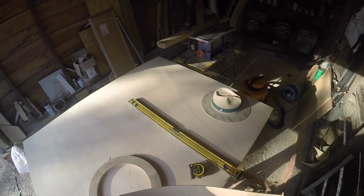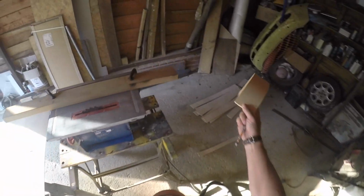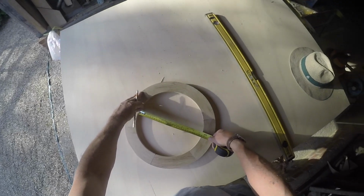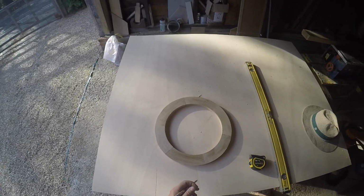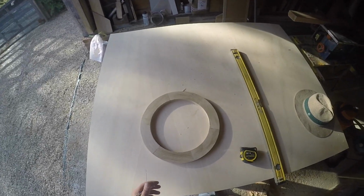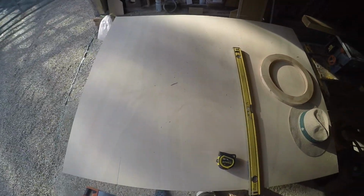So I have to make a former. Anyway, let's throw that down there. So, how we got this far is you work out the circumference of a circle. This is 29 inside. So pi times diameter equals the circumference of the circle. So 91-ish, that worked out as, so we'll do it as 91.